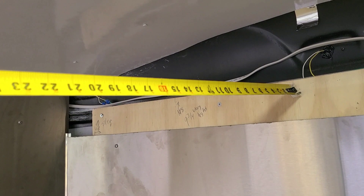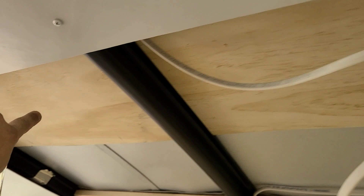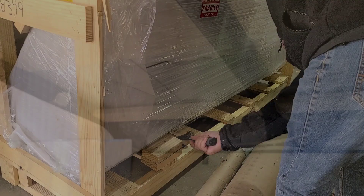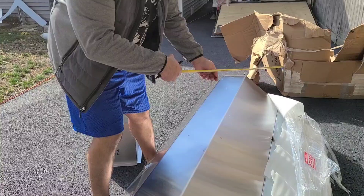Going straight to the wall and measuring 28 inches — I drew the line on the wall right there. So that's 28 inches. We're going to measure from there to this joist, and that gives us how much to cut for the exhaust hood hole. About 33 inches there — I had drawn that out already. So 33 inches is right there, and then 12 inches is the other line. It's a 12 by 10 hole. The front of the hood is on this side, so we take 33 inches and add about a quarter inch for the stainless steel — putting it at about 33 and a quarter.